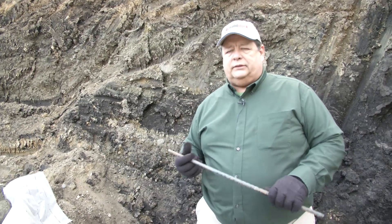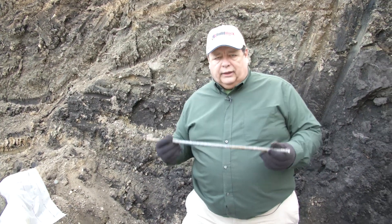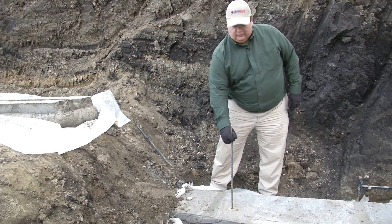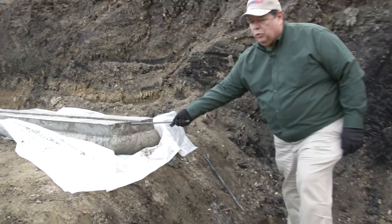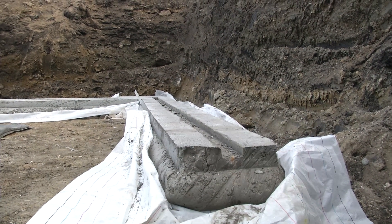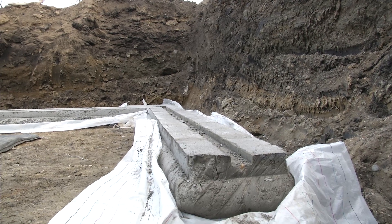There are several ways to start — we need reinforcing or a proper tie-in for our footing. Number one, as you can see, these have been pre-drilled and we're going to be putting rebar in to carry the support into the wall. If you look up here, this is a keyway — this is another system we can use. By doing an indentation in the footing, you won't have to go with your vertical steel coming out of the footing. Either way works. Basically we want to use what is specified for that particular job.